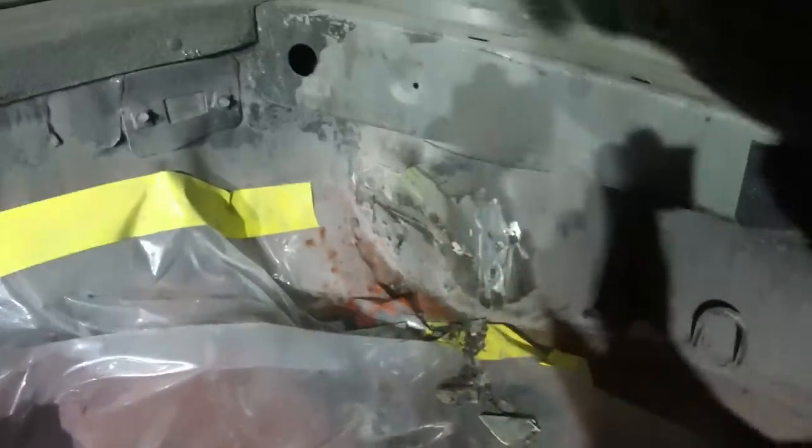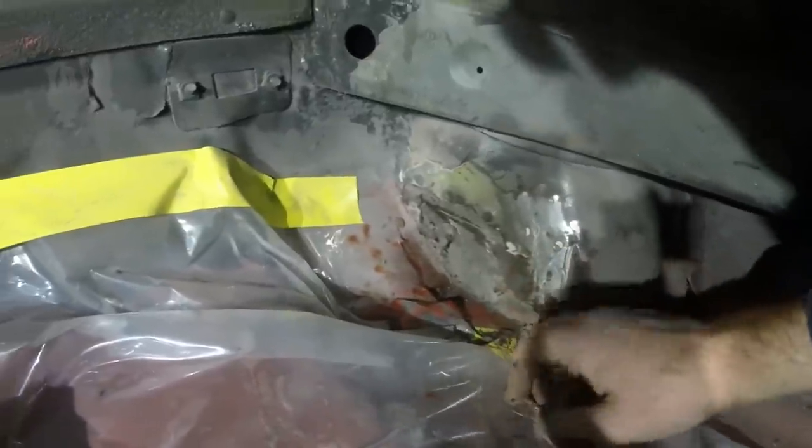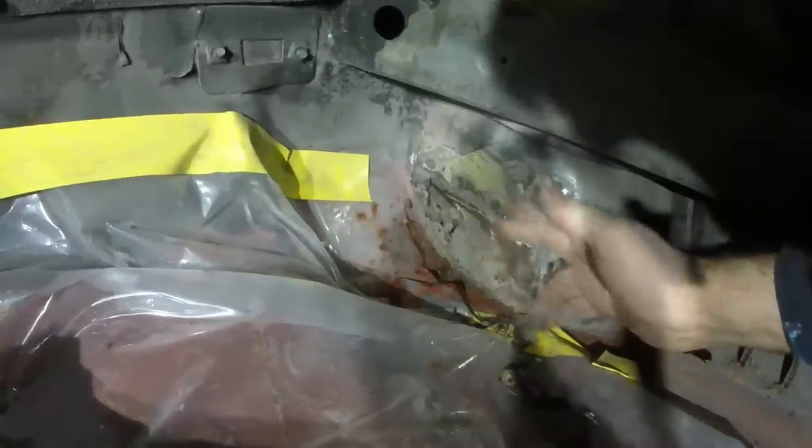Right, it's starting to make sense. On the back side of here is the reinforcer for the tie down strap or lashing point thing with the bracket. This is the original internal skin of the wheel well. Water's got in between the two and pushed the two apart. Somebody has cut the rot out and then just gobbed the whole load with filler, which is not ideal.